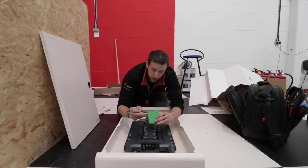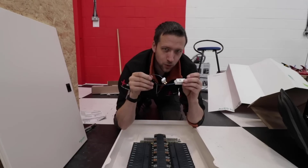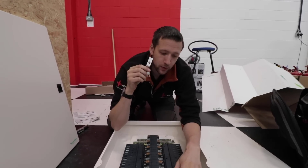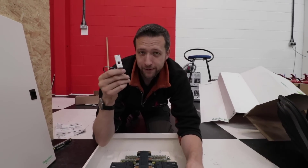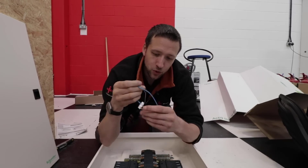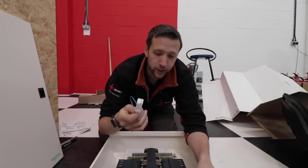They've also sent me one of these power tags to demonstrate. I know Paul has been using these on cross-rail installs and they're really clever — you put your RCBO in and place this over the conductor going into the MCB, and it feeds back data on that circuit to a computer via WiFi, giving you all the stats: load, any issues or problems. I quite like the idea, especially for large commercial situations where you need to monitor load.